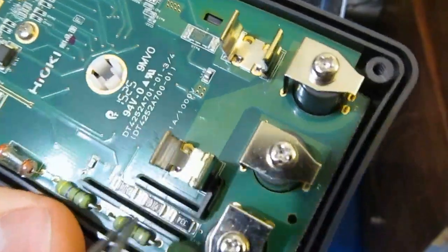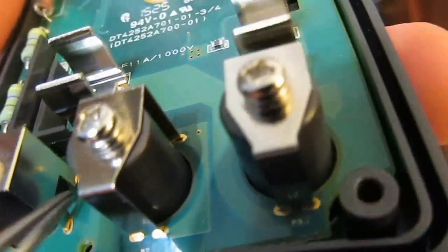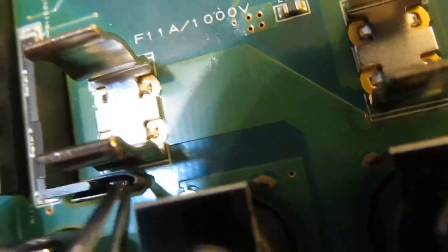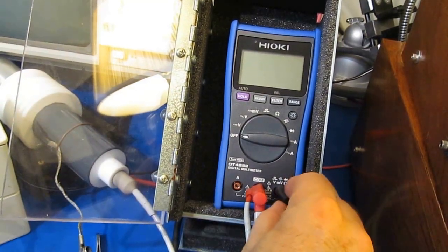What I've done is taken some high-density plastic and folded that layer up and sandwiched it around that little plastic insulator. It just hooks around the whole thing, and that increases the height of that area just ever so slightly. That basically fills in that entire void now. Let's just see if that prevents it from arcing. The meter is reassembled, and we're just going to run the negative transients on this with our little spacer in there and we'll see if it breaks down.